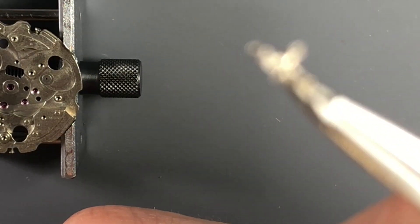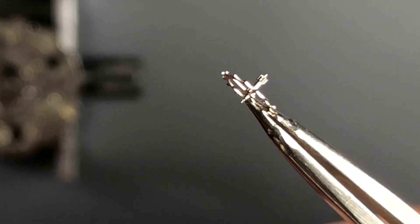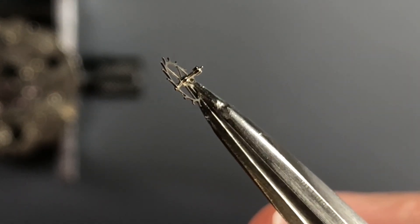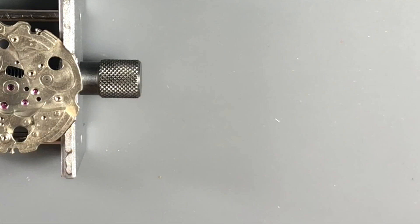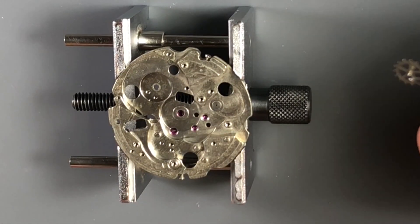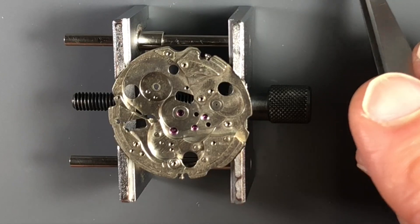There's a small black fiber — I'll try to get a close-up picture of that fiber completely wrapped around that post. I would not be surprised if one of the reasons this movement is in such good shape is that someone thought, 'this watch just isn't running very well,' and so they just didn't wear it. That fiber is obviously going to slow the escape wheel up a bit, create tons of friction that otherwise would not be there, and certainly affect the performance of this movement. We'll get that all unwrapped before we get it in the cleaner.